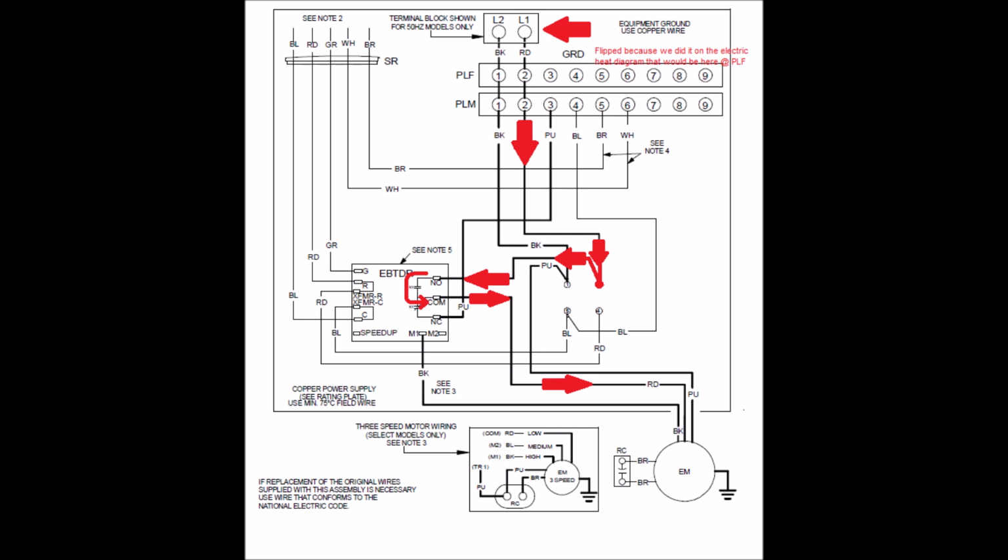So L1 down the red wire brought it to the switch, the normally open switch. That's the control for the blower. Came out the common terminal, went to the motor itself, that's the load, and now we have to bring it back. So that purple wire, if you follow it, is going to go up, make a couple 90-degree turns, and you'll see the purple goes back and makes a junction on the common terminal of the primary winding of the transformer. So what does that mean?